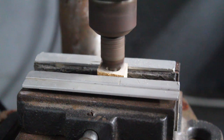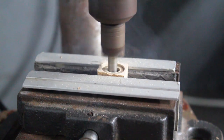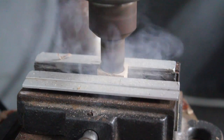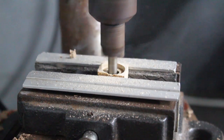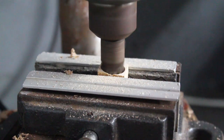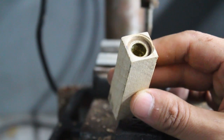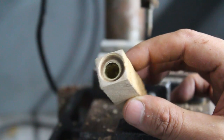That's what it looks like when the brass tube is in the wood. Now I'm going to take the blank over to the barrel trimmer — the barrel trimmer just comes in your basic pen kit and this just helps to basically make the edges of the pen flush with the tubes, so the wood is flush with the tubes so you can then mount it onto the lathe. That's what it looks like when the brass tube is in the wood and it's all nice and flush.